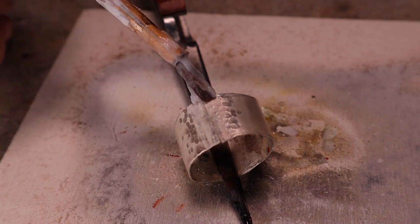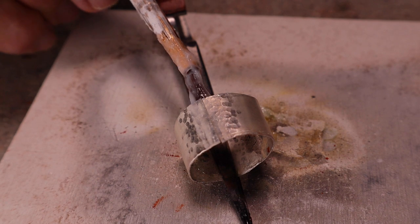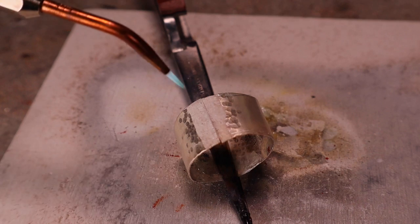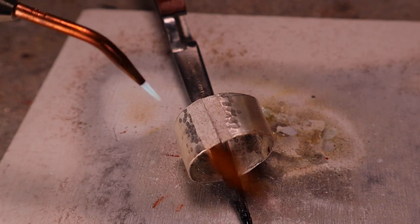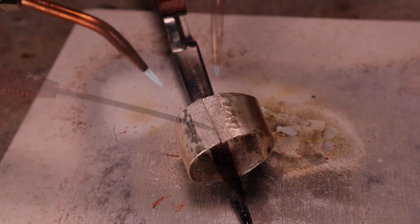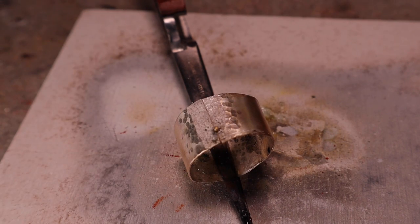An alternative to placing the solder in position before you heat the flux is to heat the flux until the bubbling stops. Remove the heat and then place the solder. Be aware that the flux, when it cools, will be a hard, shiny glaze. The solder may slip off your desired spot.